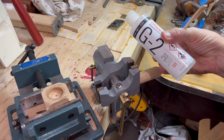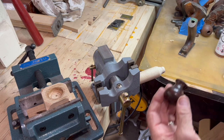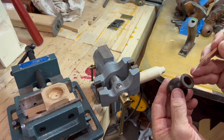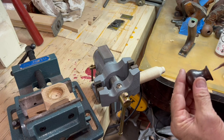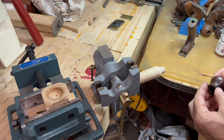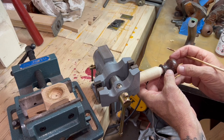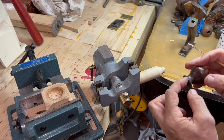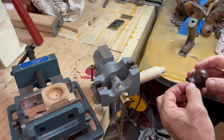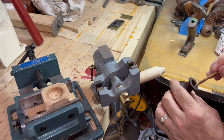For this project we're going to use System 3 G2 — that is a two-part epoxy for oily woods. I'm not going to be able to get inside and clean it out like I normally do, but we're going to open it up for sure and then insert the G2. Make sure we get a good distribution, and then we've got our little fixture. I have a conical shape I just turned on my lathe, and I'm going to press this on and give it a little twist — what that's going to do is radially open these cracks up for me, so I'm not going to pop one of those off. I take it nice and slow. We'll open this up, then we'll be able to apply a thin coating on the inside as well.